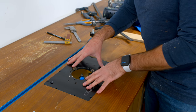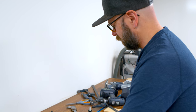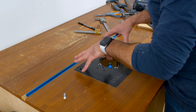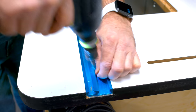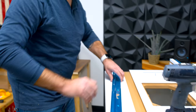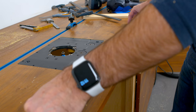I'm sure this router lift came with set screws and I'm sure I've lost them, so I need to go get some. That will level it out — you want it exactly the same height as the table. To mount it to the table, these are the bolts there. I'm just going to push that through and then put a nut on the bottom to secure that. Now I'll take out this T-Track and route a little groove for it to drop in there.